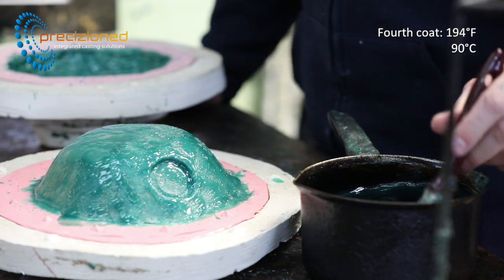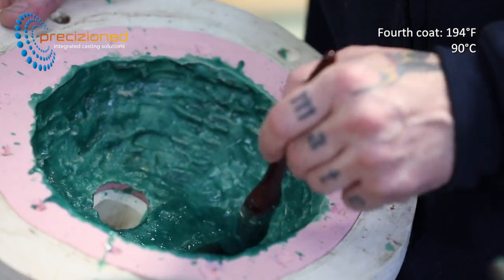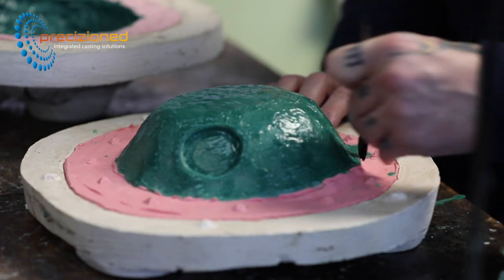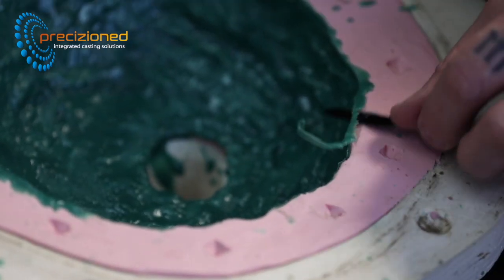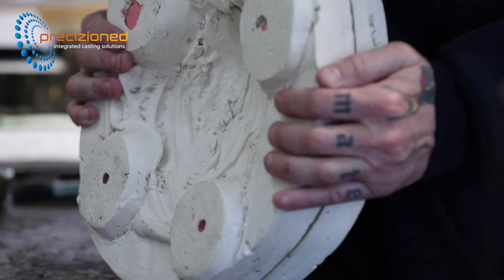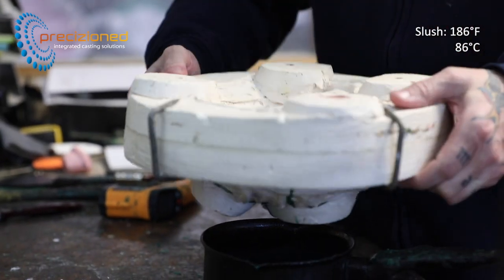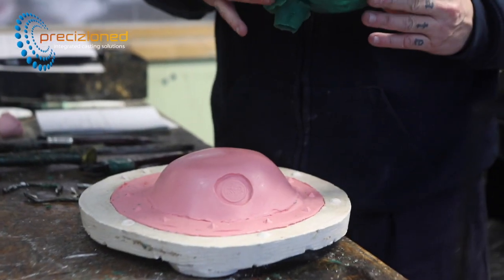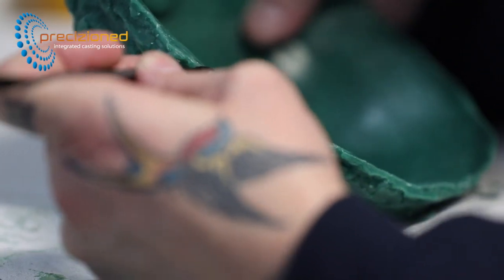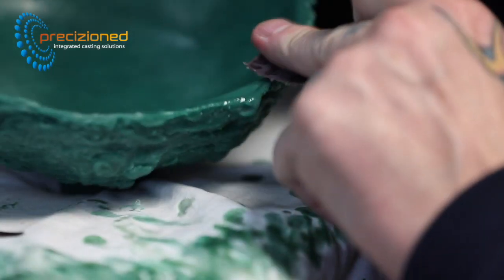As you approach the setup temperature, the wax can be applied more thickly, creating a more rigid build. Limerick Green's dry, less tacky nature means it will not stick to modelling tools, allowing edges to be very cleanly trimmed. Pouring the wax and slushing should be done no lower than 180 Fahrenheit or 85 Celsius. Once released from the mould, it is apparent how easily any excess material is removed. A final polish and the pattern is complete.